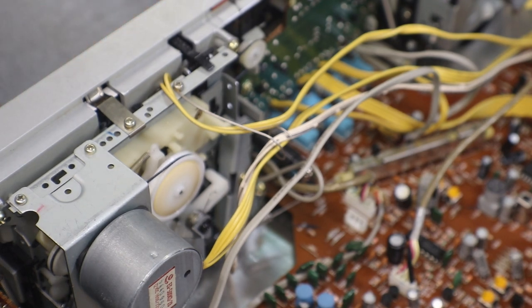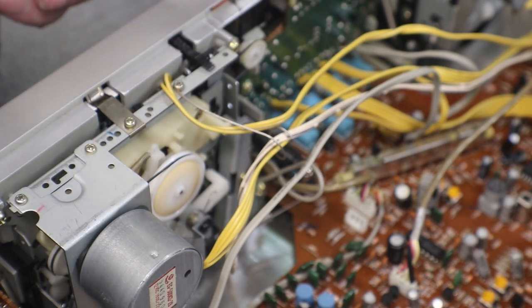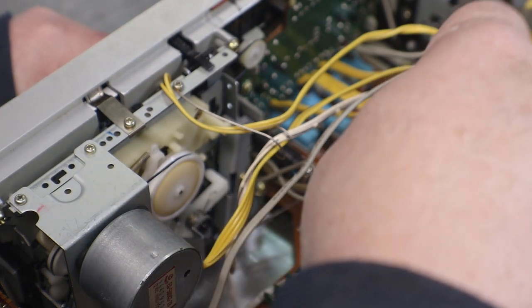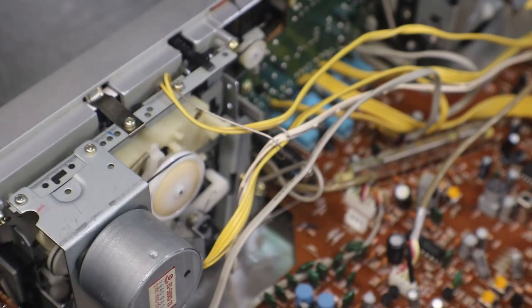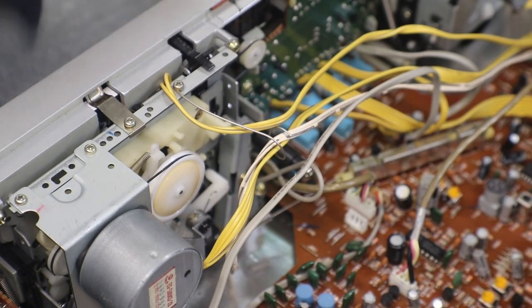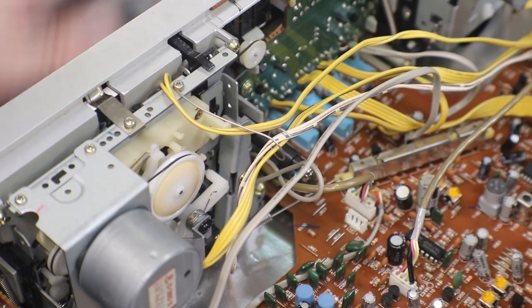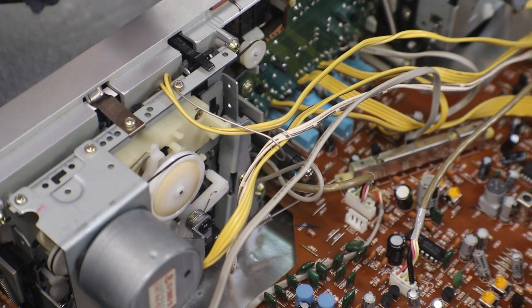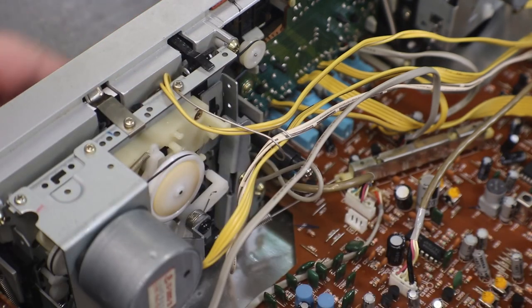And that recorded. Now it wasn't pulling that all the way out, or it was dirty. I sprayed a little bit of contact cleaner inside this slide switch, right through here. Sprayed some contact cleaner in there and just worked it back and forth with our little lever, moving it back and forth to clean up the contacts in it. Because that's what switches it.